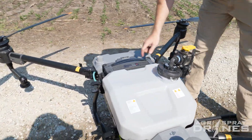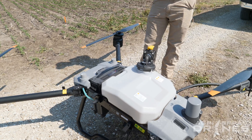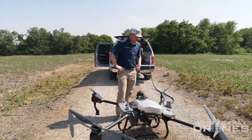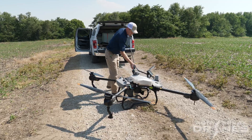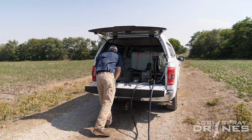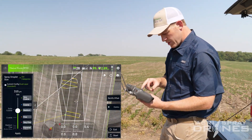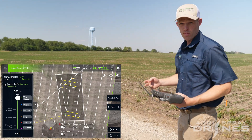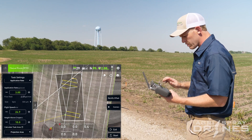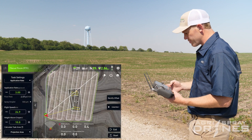While the camera was off, I swapped the batteries — we have a fresh battery in here right now. The battery came back with about 50% charge left, which should be all we need for this mission. We're going to check our droplet size. It is kind of windy today, so we're going to put this on very coarse, especially with herbicide. We're spraying water right now, but if spraying herbicide you want a very coarse droplet to reduce drift as much as possible. Everything else looks good.